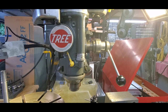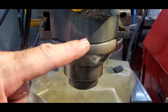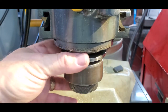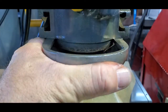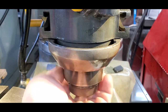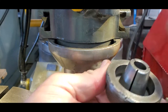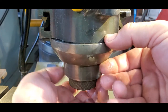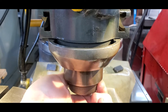Here we are at the Tree milling machine. You have a built-in collet closer right here — uses the handle. One of the important parts of this collet closer is this yoke here. It fits in here — that's what pulls the collet closed. You leave that on, but it'll open a little. Right about there there's a nut, and in there's your collet. See that — that goes up in the nose.